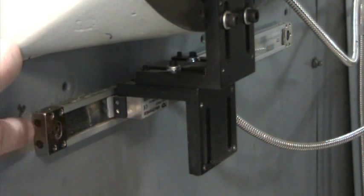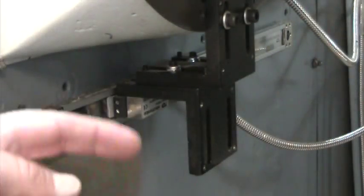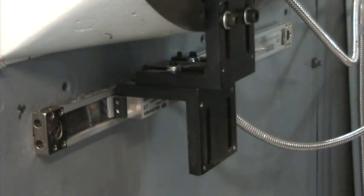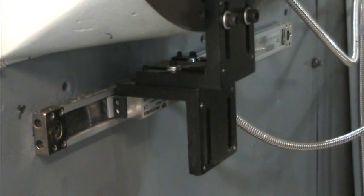It's a little more than a 12-inch slide - the slide is a little proud of the reader both in the positive direction and on the way back. Just like we did on the X-axis, I drilled into the side of the cast iron, tapped it, put the bolt in, and ran the indicator to make sure the slide was level. This one doesn't have any of the tilt problems the table did earlier.